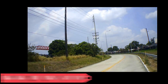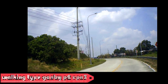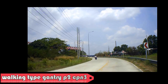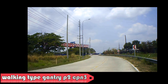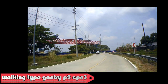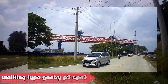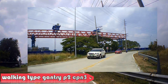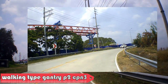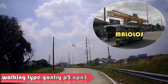Front and middle legs can be adjusted randomly in the core plate with adjustable angle, which can adapt the erection of curved bridges and slope bridges. According to the angle of slope bridge, the user can adjust the front and middle legs when a slope bridge is erected. Therefore, it can be used for any angle slope bridge up to 45 degrees. A transverse trolley is added to the lifting trolley, and the whole walking type bridge girder launcher traverses with a boundary beam, which resolves the problem of installation of the boundary beam.